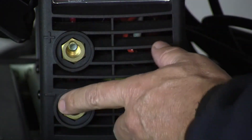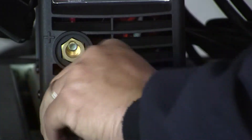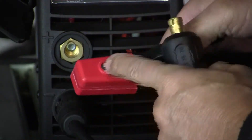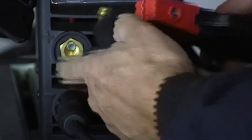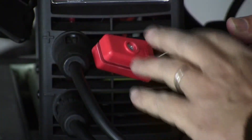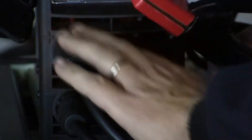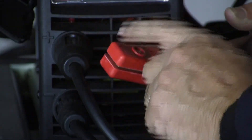Here's our positive disconnect and our negative disconnect. We're going to connect the ground clamp to negative and the stinger to positive. This is DC electrode positive — the welding rod comes out of the stinger and we want DC electrode positive, primarily because most electrodes you're going to use are DC positive electrodes. There are a couple that can handle negative, like a 6011 rod which can go DC electrode negative. But most rods are AC and DC positive, so that's why we're going with DC EP for this setup.